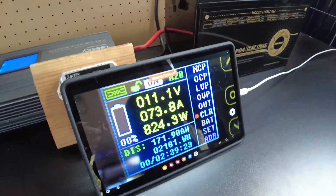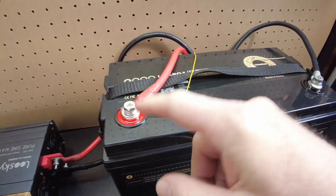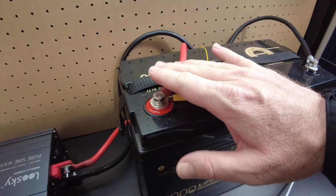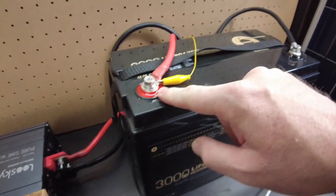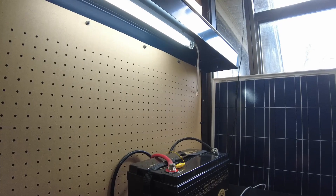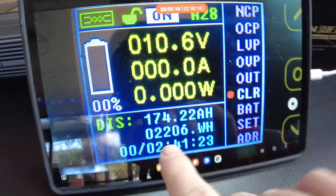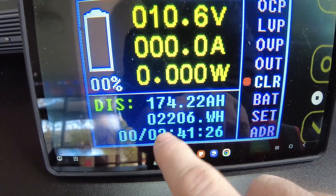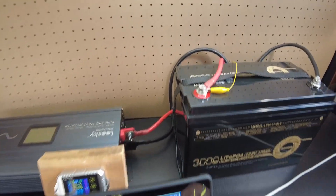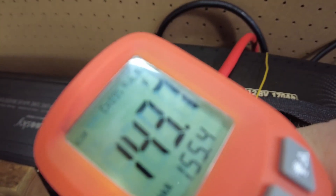Let's see how far it'll go. That terminal is very hot — I'm actually concerned with how hot this terminal is, and we're only pulling 71 amps. The inverter is screaming, so let's turn that off. We have reached 174.22 amp hours and 2,206 watt hours — so it pulled full capacity. Very nice. This terminal is very hot though — I'm seeing 150 degrees.